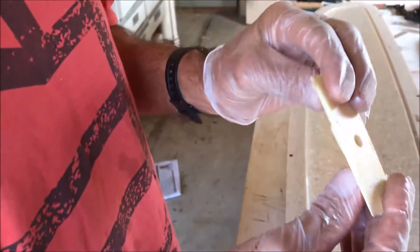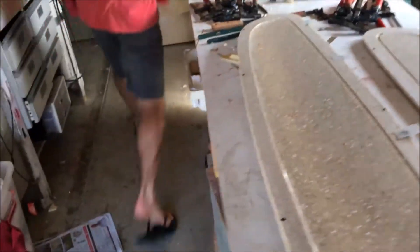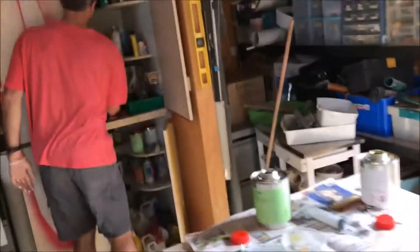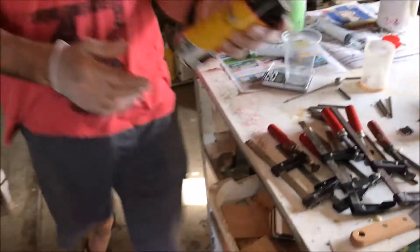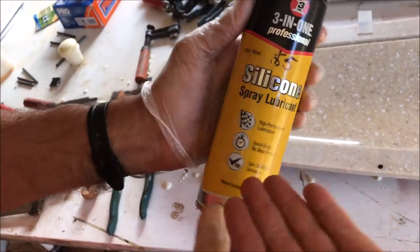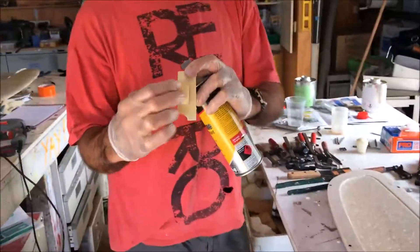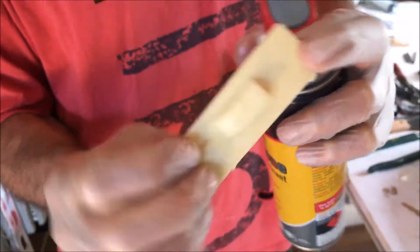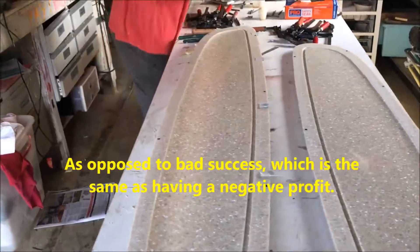So that's the thing. This is a little test section I did on a couple of scraps the other day. Another important thing — we've grabbed some silicon spray lubricant and sprayed the molds with it. Listen — no thud at all, it's like plastic. This simple cheap silicon spray is magic; it's completely allowed it to pull out even though there's no draft angle on that section. This thing's as hard as a rock and it pulled out okay without breaking. Good success with that.